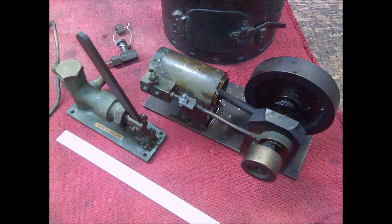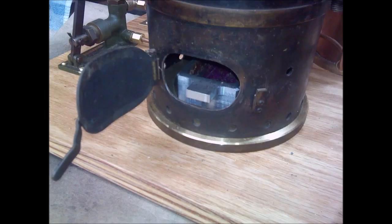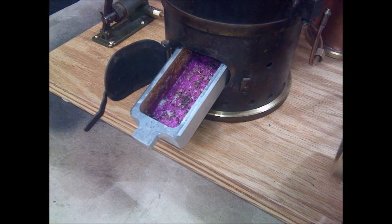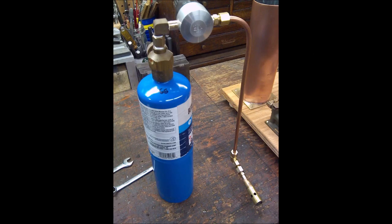If you remember from the first part, I took parts of a system that I bought this summer at an antique shop, put them together, put them on a board, and created this little system. It ran okay, but it took 45 minutes for the sterno to bring the boiler up to temperature. I made the container out of billet aluminum so it would just fit through the door, and it didn't do the job. So we're going to upgrade to propane.